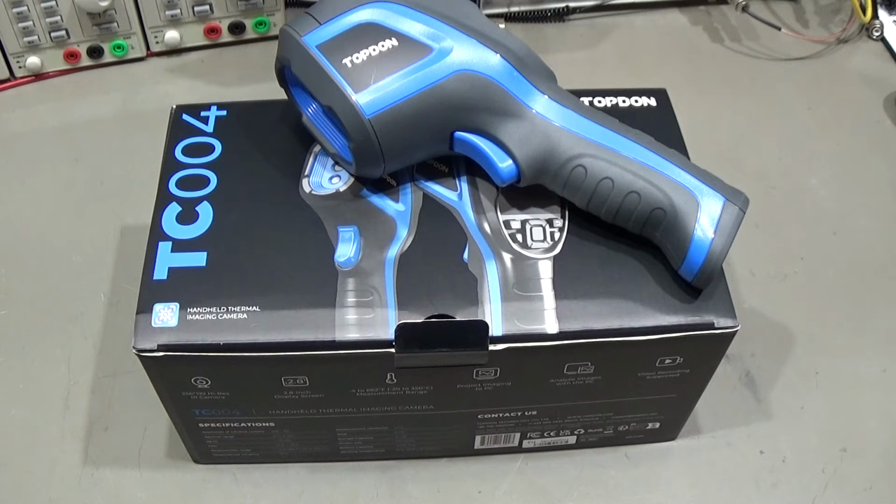Now we may be able to imagine why it is important to have both with a good value: the IR sensor resolution on one hand, and the NETD on the other. If both are at a good level, then you have good and clear pictures, and we do not get something blurry. And that was what we had in the beginning of IR cameras. We only got a blurry dot, but it was not really possible to distinguish what we see there.